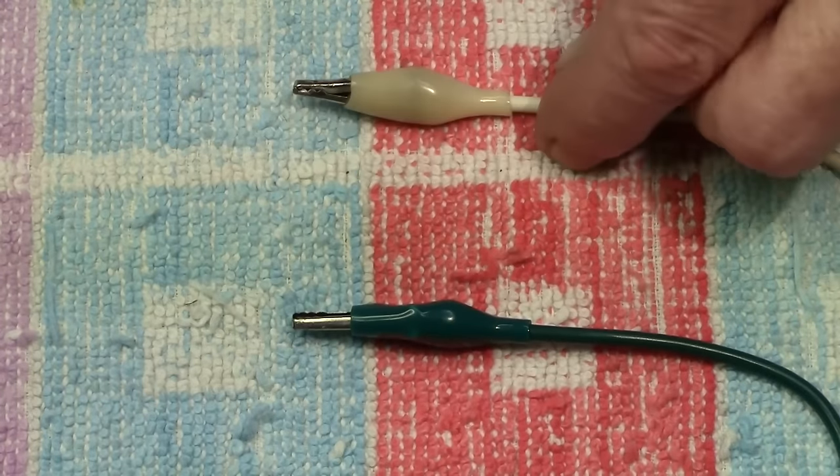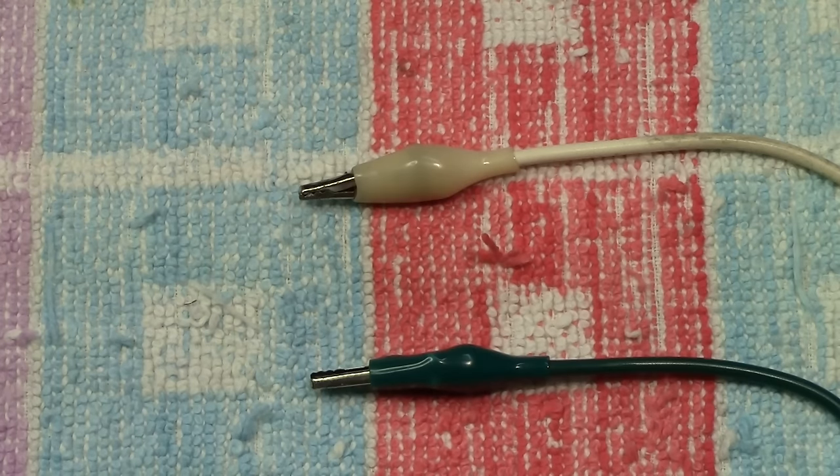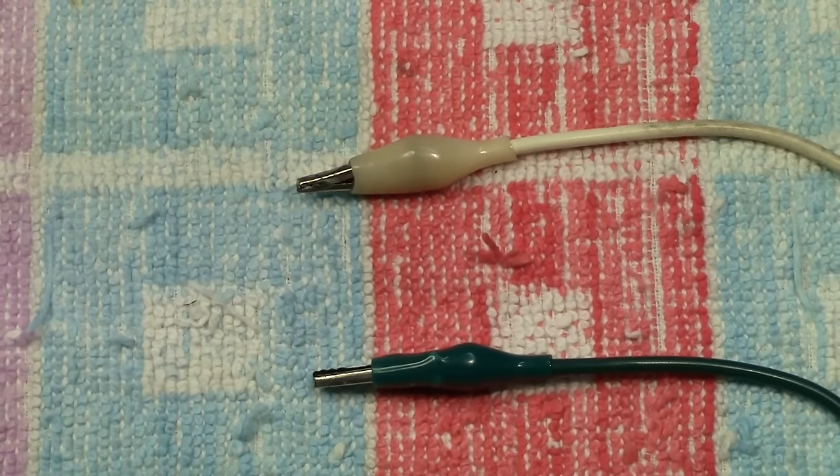Now, most locomotives do run on DC, the direct current, for the motor. With AC electricity, alternating current, it's actually doing exactly what that says. It's alternating, and it switches from one side to the other of the 2 wires 50 times a second. That's what it means by AC, 50 cycles. AC doesn't really have a polarity as such.